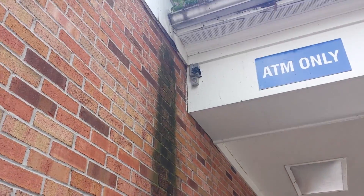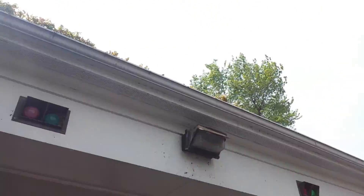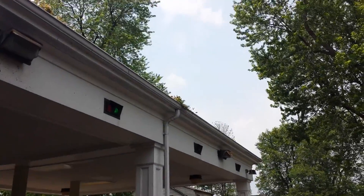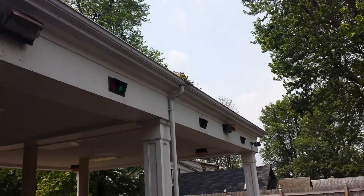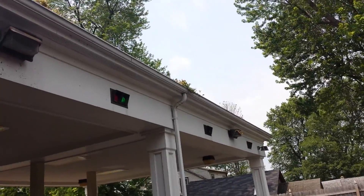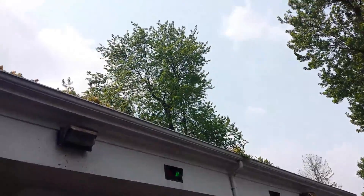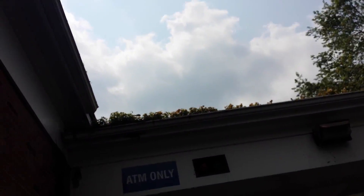After this is done, the brick needs to be power washed. The gutters are too small for this amount of roof line — they've got standard five-inch gutters with standard two by three inch downspouts. I'm going to recommend changing these to six-inch gutters and three by four commercial sized downspouts to handle the load, and I'm also going to give them the option of gutter helmet to help keep the debris out.